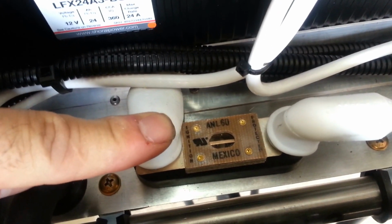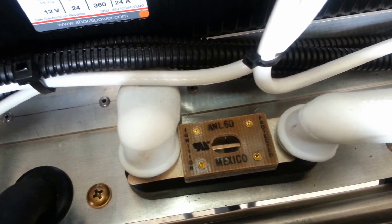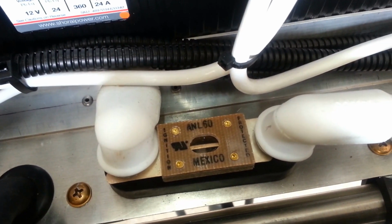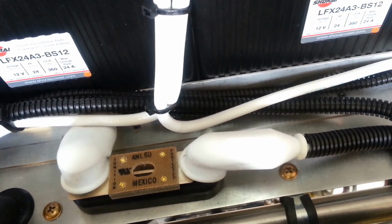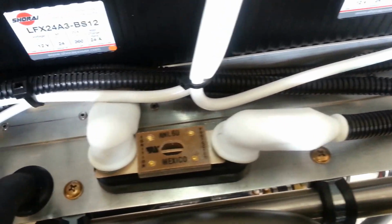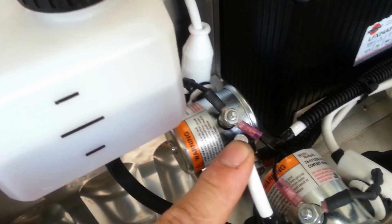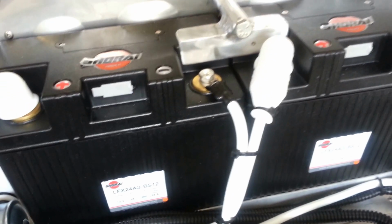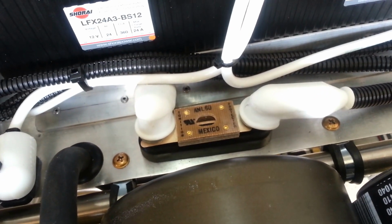Now, if you do want to have a shunt for the alternator, meaning something that will measure amperage in your airplane so you can actually see if the alternator is producing current or not, you can put the shunt in this alternator wire cable. That means you will have two items in the cable before it reaches the section in between the solenoids that are the hot part that then charges either battery 1 or battery 2. Meaning that the cable that goes from the alternator and eventually ends up at one battery or the other will have two items in line with it: one being the fuse and the other being the amp shunt.